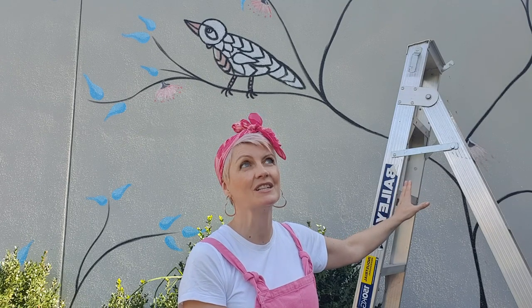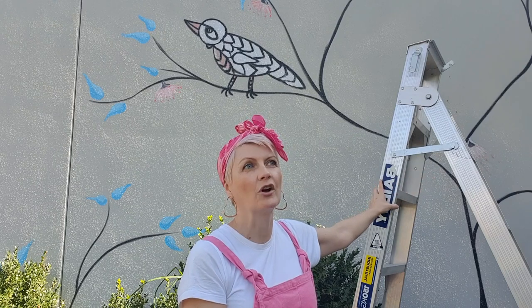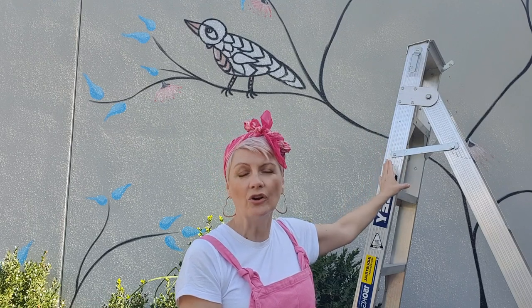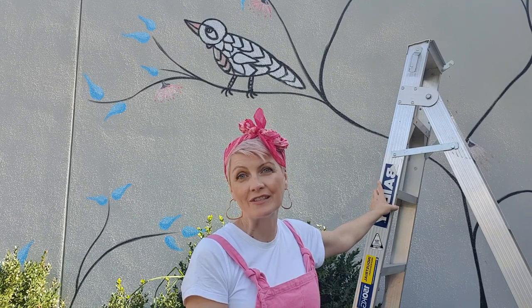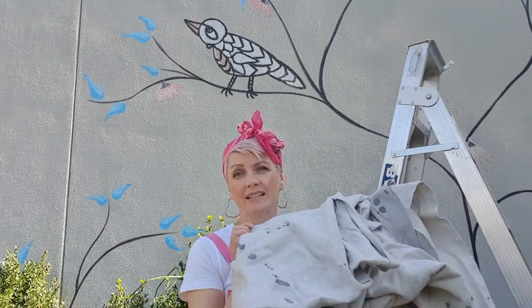A note on ladders: I'm the only one who goes up a ladder. I don't let the kids - even grade 6, eleven or twelve year olds - go up a ladder; it doesn't fit with OH&S, occupational health and safety. I'll get a kid to hold the ladder and put their foot on the bottom rung on either side while I'm up it. At school I use little platform ladders that open out with a platform to stand on. Be careful not to overreach - get down and move the ladder each time. Always have someone around, or keep your mobile on you and let the office know you're going up a ladder.